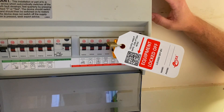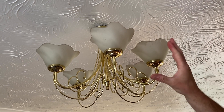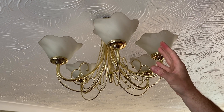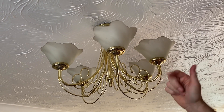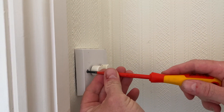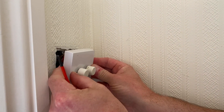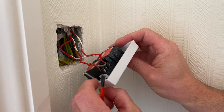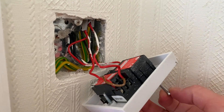The lights in the living area have now gone off, but that doesn't confirm we've isolated the correct circuit — something else could have gone on. We still presume the circuit could be live and take all necessary precautions to prove at the light switch that this circuit is isolated before changing the dimmer. I'm going to remove the dimmer carefully, being cautious in case it is still live. Don't let conductors fly out, and if they do, don't touch them until you've proved the circuit is isolated.